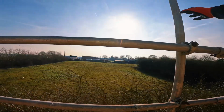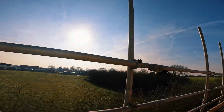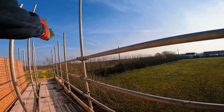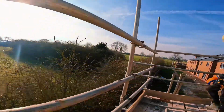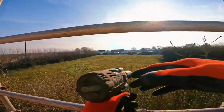Now back into that. My next lift handrail, I'll make sure it's in this bay because it'll become my ledger on the next lift. Make sure it's 25mm past this leg now, not the one that I said down there, because I've slid it all down. Tighten it all back up. My little mess up that. Fish back. There we go.